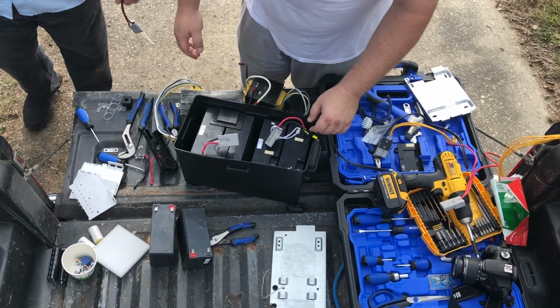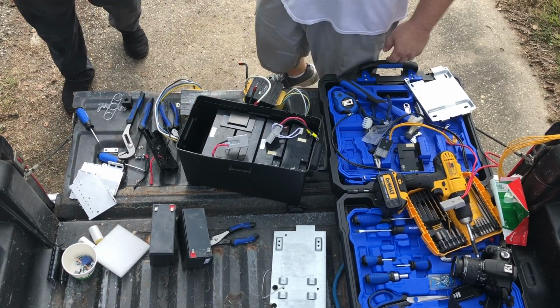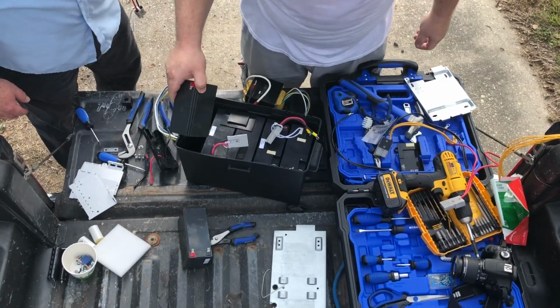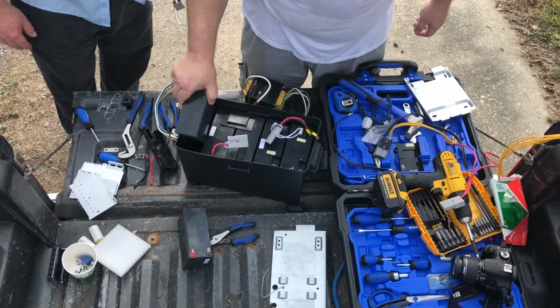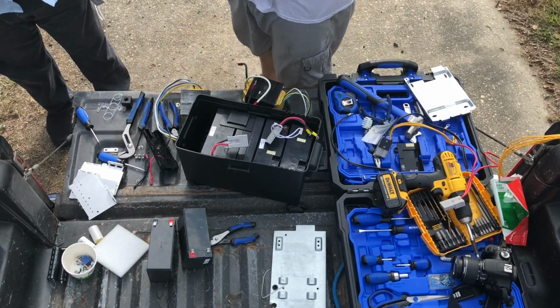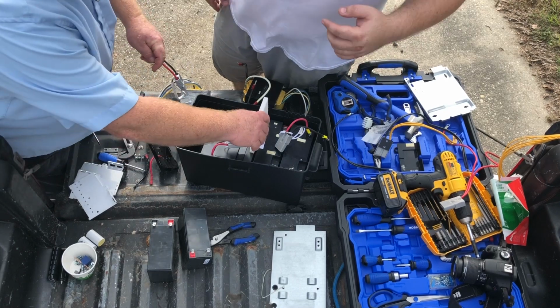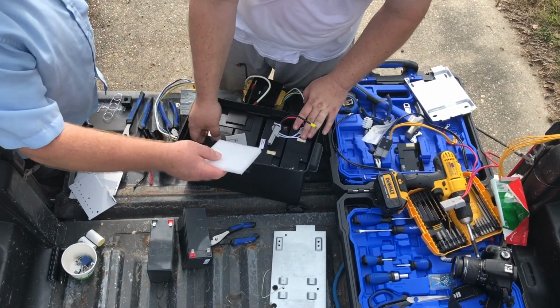And you can see there's all 4 with a little breathing room inside, and I couldn't have asked for a better setup without planning it ahead of time. And here I was just getting greedy, but no, they won't fit. But here we've got the 4 12 volt batteries that are 15 amp hours apiece, giving me a total of 60 amp hours in that setup.